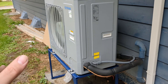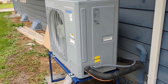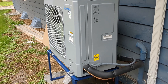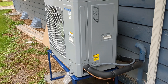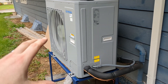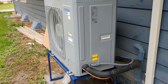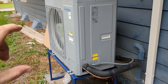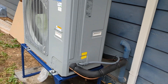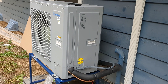If you've got their A-coil, their air handler, and the NOVAC line sets, this would probably be okay for some people to tackle. People may ask why I didn't buy the 2-to-3-ton coil that comes with this unit. Due to the space constraints with my evaporator on top of my furnace, I don't have room for their coils, so I had to buy the shorter N-coil from Rheem. I upsized it in capacity, so hopefully it'll run a little more efficiently, though I may lose some humidity removal ability with a larger coil at a lower fan speed.